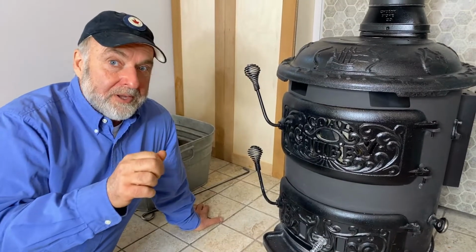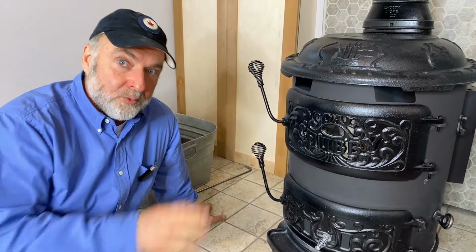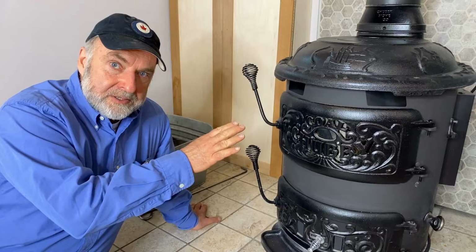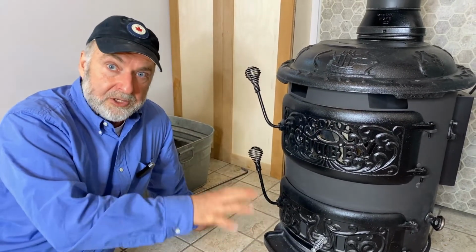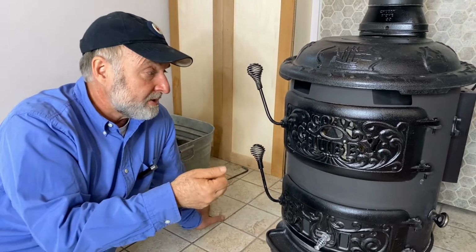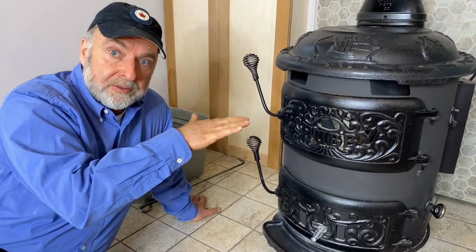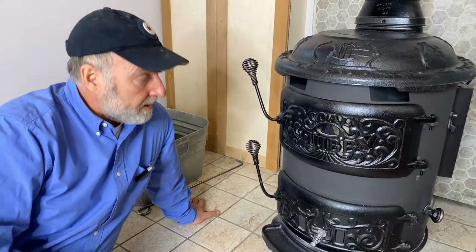One thing I want to point out to you, and this highlights one of the differences between wood fire and anthracite. I serviced this stove 2 hours ago, which means knocking down the ash, opening up the passages for the air, reestablishing those passages, and then topping up the burn pot inside with anthracite, so it's level with the top. So 2 hours ago I did that.